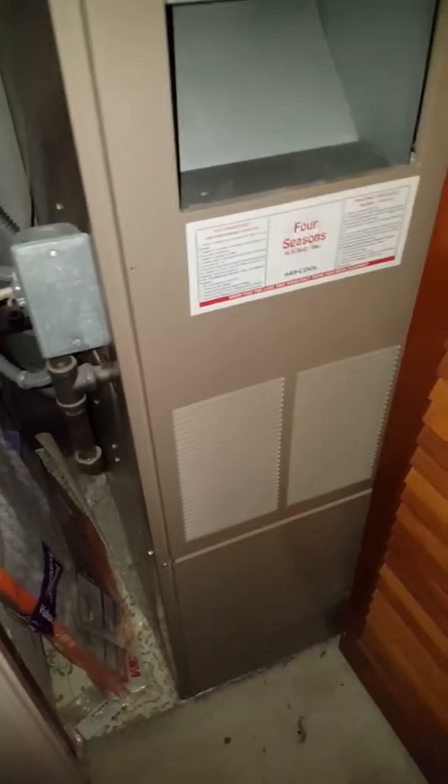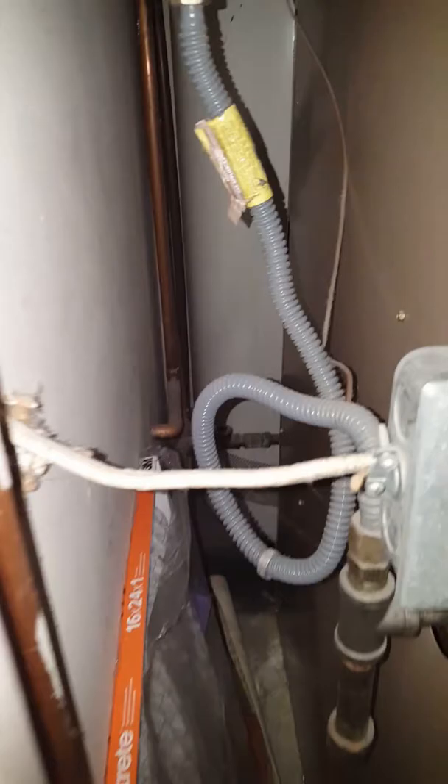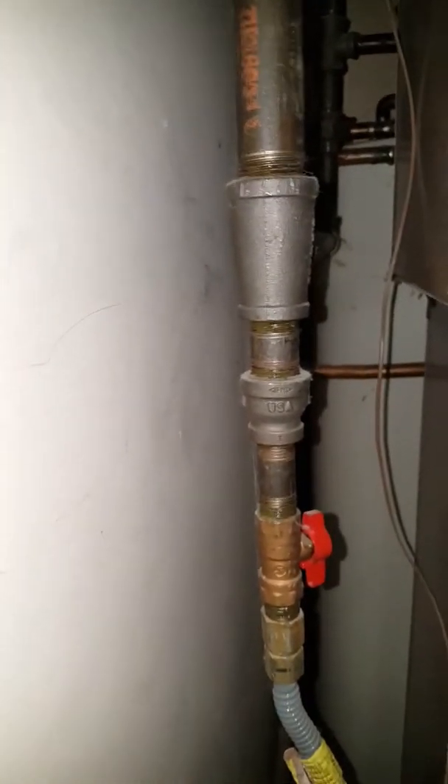This is a video at the Johnson residence. We've got an old Maytag furnace here that's got a bad heat exchanger on it. It's 50,000 BTU. It's got a half-inch gas line coming in the side with a handle valve on it, which is good. I don't have an electric shutoff — I need to put a switch on there for an electric shutoff.